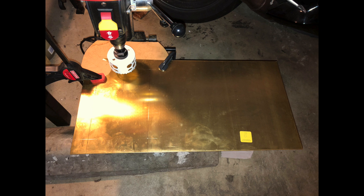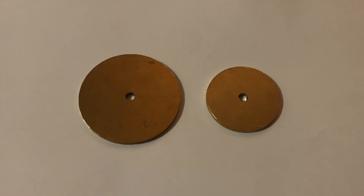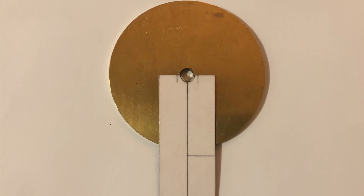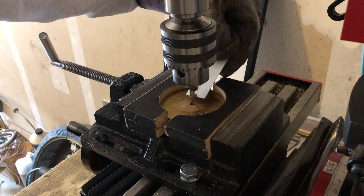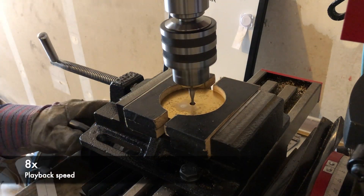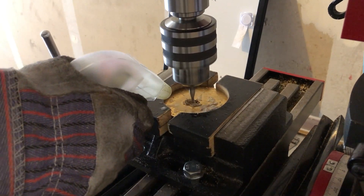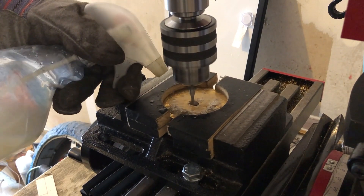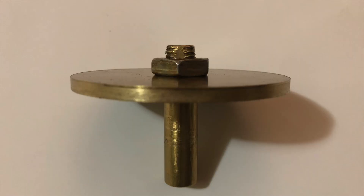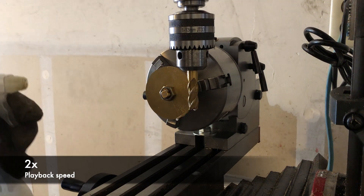For the next gear I'll be using sheet metal and a hole saw cutter to make the blanks. I won't be showing that because there are several ways you could cut or buy your own blanks, but you will want a way to center the cutter. In this case I will use a paper strip with the center marked and cut into it — the strip allows me to do the centering while the blank is in the jig. I just have to cut the square drive hole. I'm using a square drive connection because it gives me more adjustment options over a keyway — you could think of it as a gigantic keyway and drive bar in one. After mounting it onto the adapter and clamping it into the chuck I can begin cutting it down to the correct outside diameter using the same technique as the 12-tooth gear.